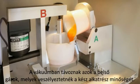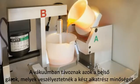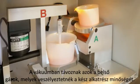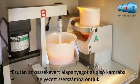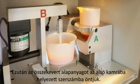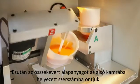In addition to the standard mixing cup, a heated cup is also available to enable wax patterns to be cast. Once fully mixed, the resulting casting medium is then automatically poured into the silicone mould in the lower chamber.